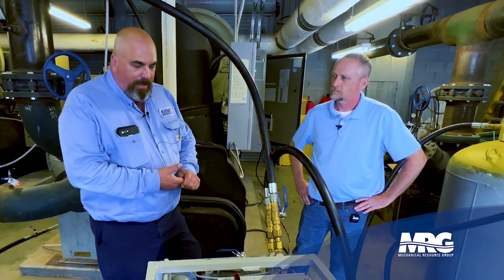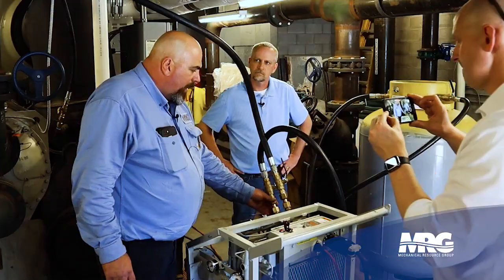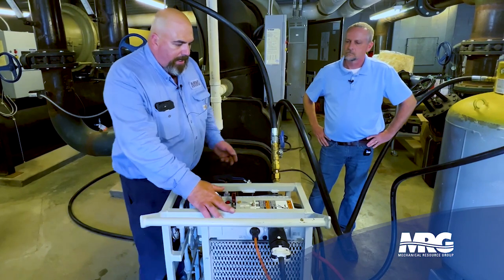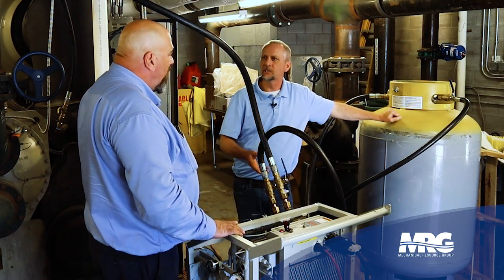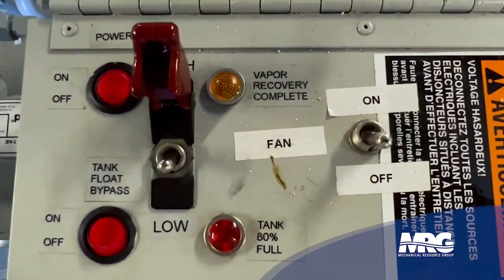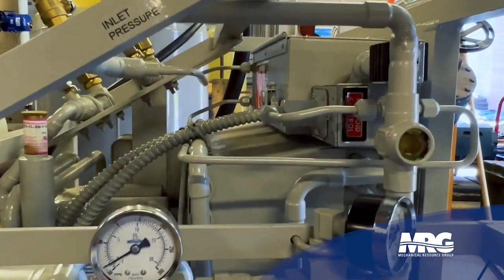Once all the liquid is out, we convert to a vapor pull. We'll go ahead and isolate these valves, move this hose from our outlet to our inlet, and then get a hose directly from here — the liquid — to the liquid port on our recovery cylinder. At that point we can go ahead and start our fan and start our water flow through our liquid-cooled condenser. There is a built-in vacuum switch that will cut the machine off at approximately 600 microns. Once we're down to a deep vacuum it'll shut the machine off automatically, and then we know we're done recovering gas.